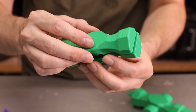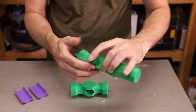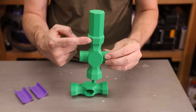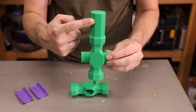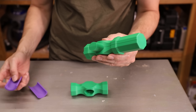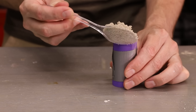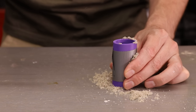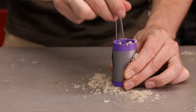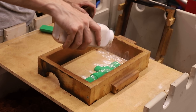So this is what the hammer is going to look like, but I can't just make a mold using this, so that's why I made this weird looking pattern. I'll cast the hammer vertically, and the mold will fill from the bottom up. This large piece on the top is called a riser, and it'll supply the casting with metal as it solidifies and shrinks. I'll use these purple pieces as a mold to make a core using sand and sodium silicate. The core is what will form the hole running through the hammer, which is called an eye. If I'm not explaining it very well, things will start to make a lot more sense as the video progresses.